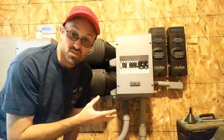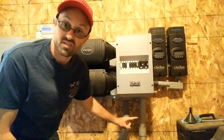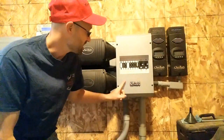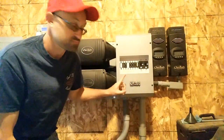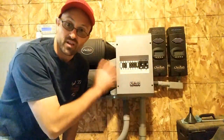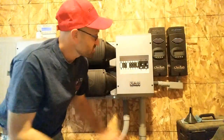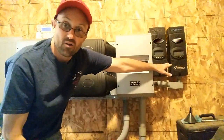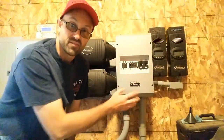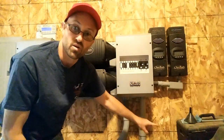When your power comes into the shop, it comes in through underground conduit — that's how we always wire it in. These are the inputs coming in from the panels, bringing the power in. It comes up into a distribution center and then goes over to your chargers. The power here doesn't go straight to your batteries — you want something that controls it to be able to charge your battery bank. These are dual power controllers or power chargers; one runs as primary, one as secondary, and they go back out into the battery bank.